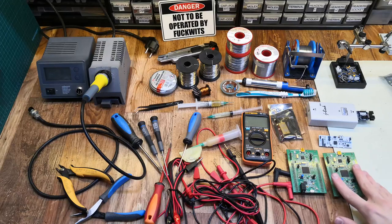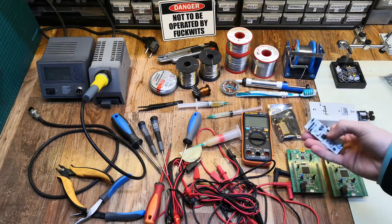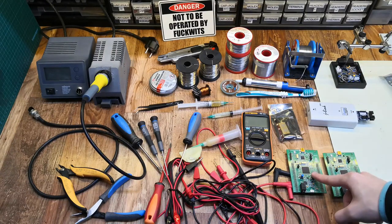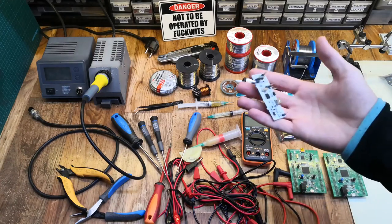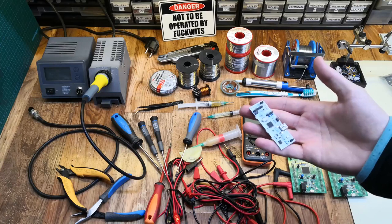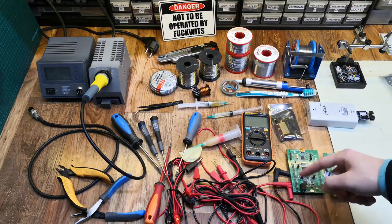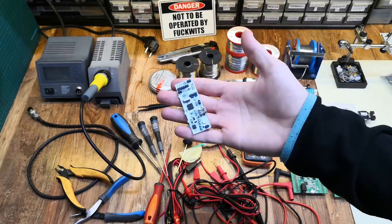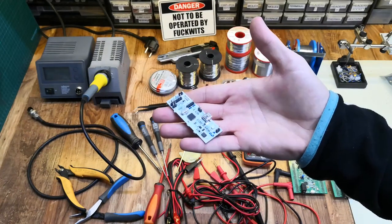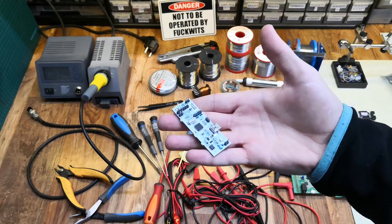As I said, have multiple dev boards. As you can see I have two of these Discovery boards which I really like. I want to suggest you to have one Discovery board to learn and also to debug — this one is a great option — but also buy the Nucleo boards because Nucleo boards are really fine: they have all the pins exposed and none of them are occupied by unnecessary onboard peripherals. You can also take off the actual debugger, the ST-Link part, and use it as a standalone programmer.